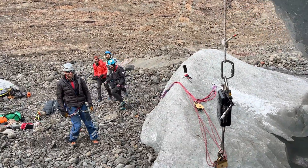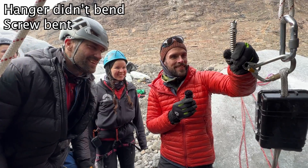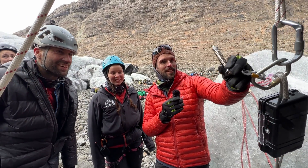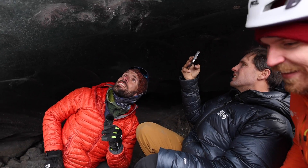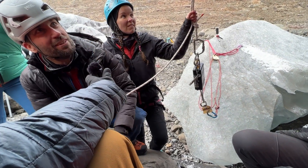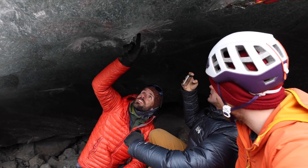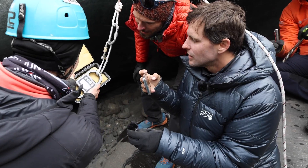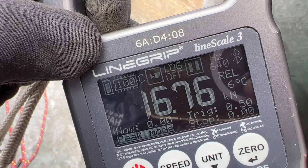That's amazing! I'm more curious about how hard you guys pulled than the result. The hanger doesn't look bent at all, but the screw actually bent. It was properly hard and it wasn't angled that much different — it just made such a huge difference. The hole completely coned out — real bad conage over here. That was a nice clean break. You could see when we were pulling to four kilonewtons there was ice drizzling down. Every time we yanked on it there was just a little extra motion. There's some breakage here; if we do 10 degrees towards us we can eliminate some of this and get more of the threads working.